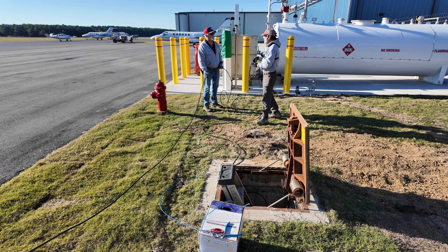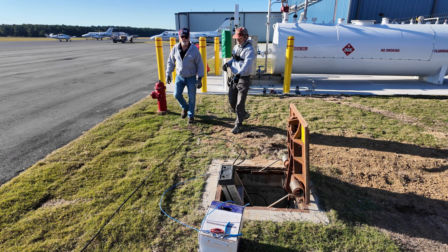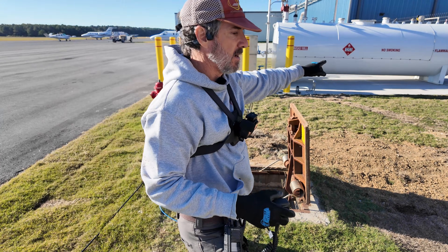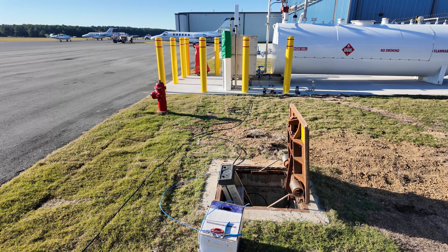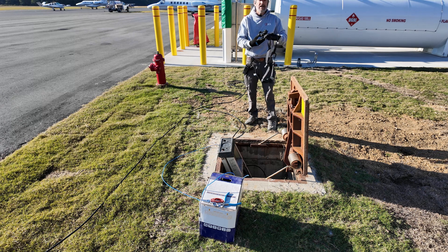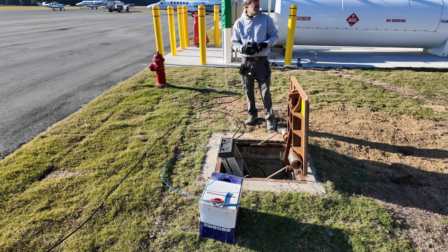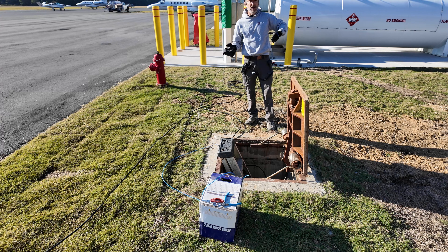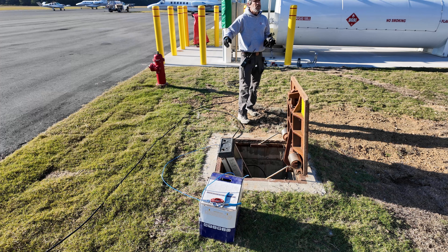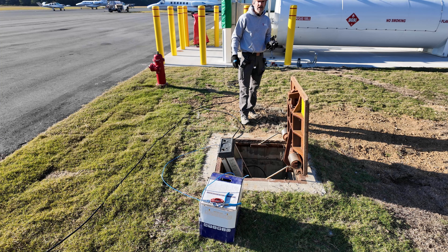He's going to pull about 20 feet in — he's got the fiber. He just called on the radio and said he had the fiber inside the MDF in the new building, so Jimmy's going over to help manage the slack. They're going to pull about 20 feet inside the building out through the pipe. Then we'll get all this fiber off the reel, figure-eight it out in this grassy area, put a little cable gel on there, and it pulled nice and smooth.